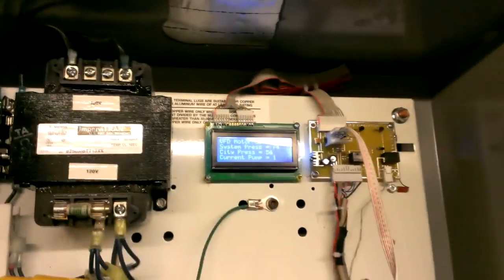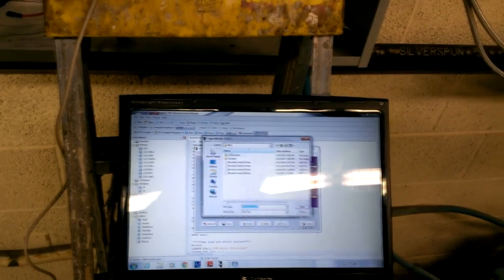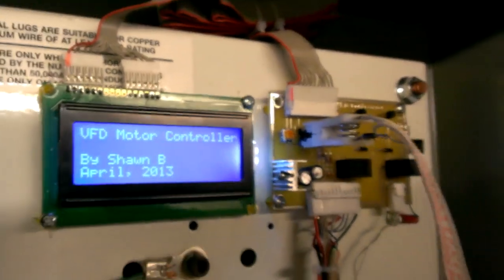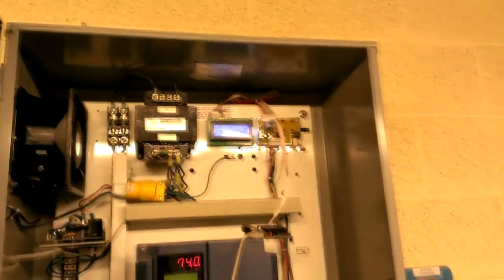I'm trying to update the program so I can get the scale correct. I'm reading this other pressure sensor. Load that file. Okay, so right now it's writing to the EEPROM — little cable right out there. It's pretty much trial and error. We used the older transducer and it's not 0 to 10 volts, it's 1 to 11 volts — it's just kind of weird. I'm not going to be able to read that last volt because my input is going to clip. But it's pretty close now — pressure is dancing around there a little bit. Now I just got to reprogram the low pressure cutoff to come in a little earlier.